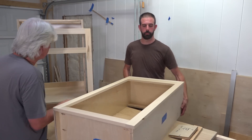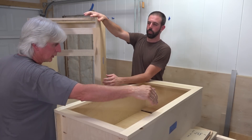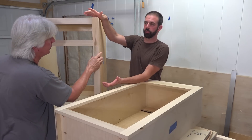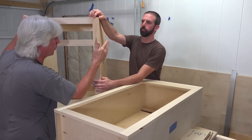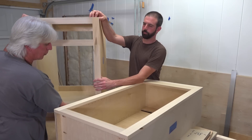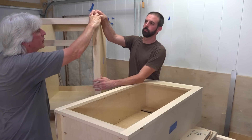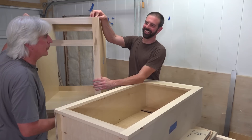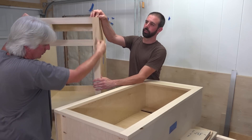On the bottom cabinets, pretty much the same condition side to side. This bottom cabinet will be under the top cabinet, with the wall on one side and the sink basin on the other. So we do need a little bit of a reveal on both sides — we need a quarter inch on both sides. This accommodates for the wall, and you want a quarter inch between cabinets so you have room to line them up properly in case there's a little crook in the wall. On bottom cabinets, you don't want to line the bottom up — if it's a little bit long and that top sticks up, that's going to throw your countertop off. Line it up with the very top. Get it good and flat and square. If you have a little bit off on the bottom, unless somebody lays on the floor and looks up under that three and a half inch toe space, you're never going to see it.